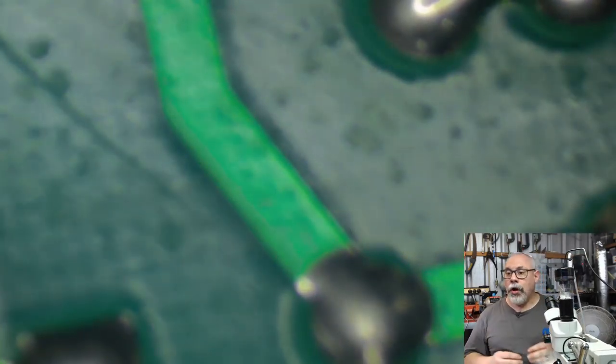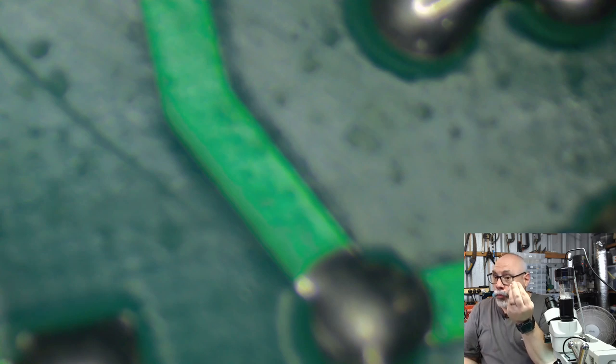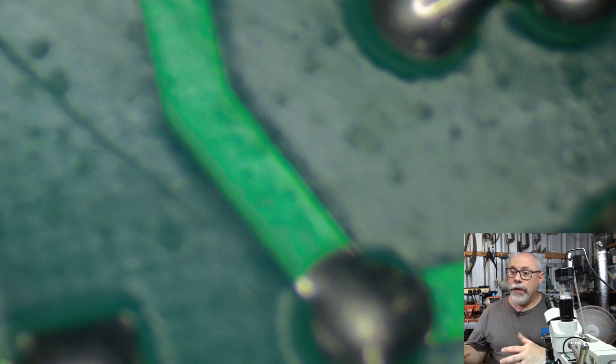As these joints get old, you have the pin coming up the middle and the solder going around the outside, and over time, through vibrations or weight, that pin starts to work away from the solder around it. You end up with a little gap around it, and then it's not making proper contact. When the board warms up, those things sometimes expand and make contact again. So when you have a computer that doesn't work or works better when it's warmed up, I would always be looking for cracked solder joints.